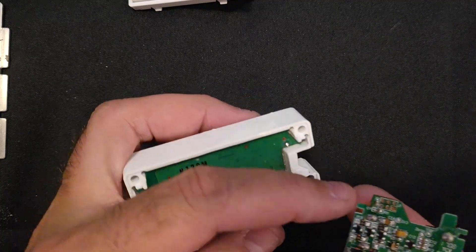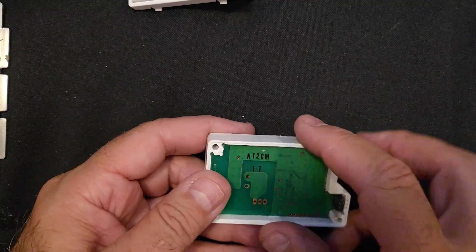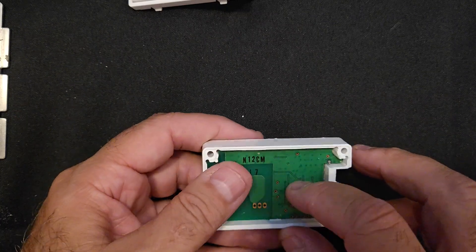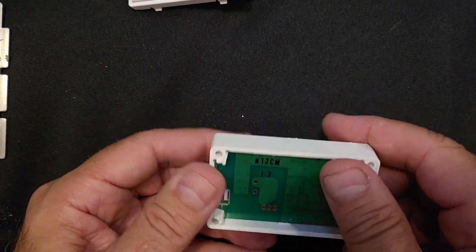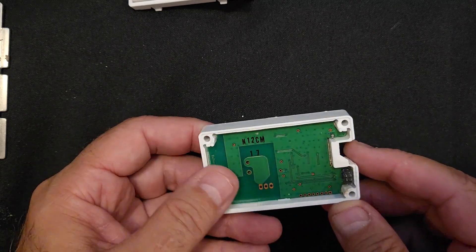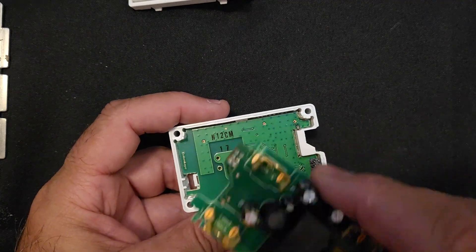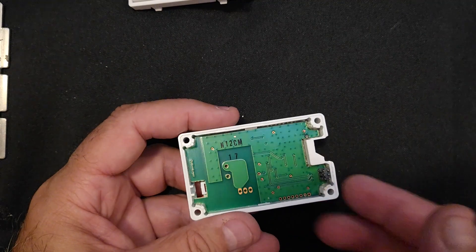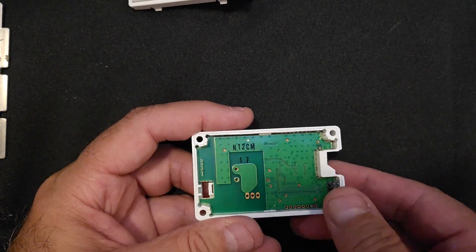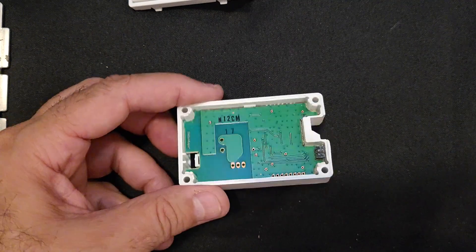So here's what I found — it was easier to unsolder the pins from the top board to take this out. But if you did want to take out the bottom board, there is a little tab on each side that you have these two openings for that will release that bottom board — but it's really tight, it's just a pain. Either way you still have to unsolder the top board to get to the bottom of the circuit board to replace anything like the capacitors. Much easier to just unsolder the six pins at the top. Use a lot of flux — I highly recommend it. The solder on these pins holds them pretty well.